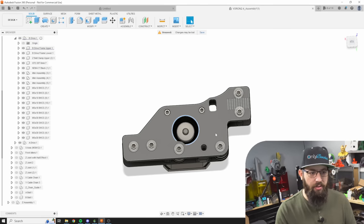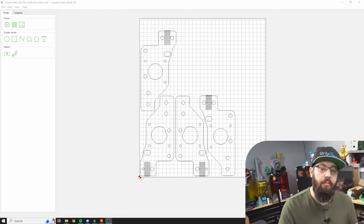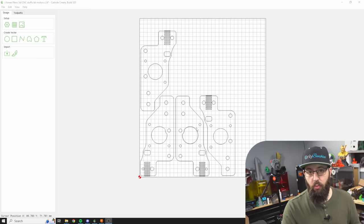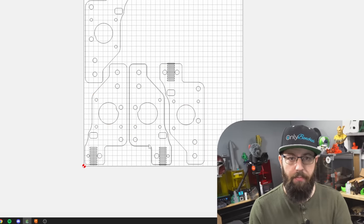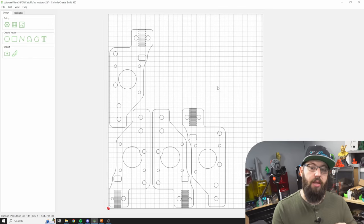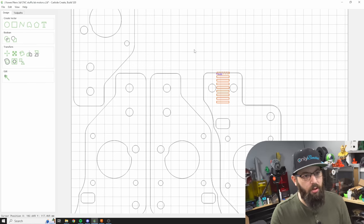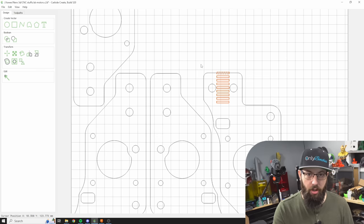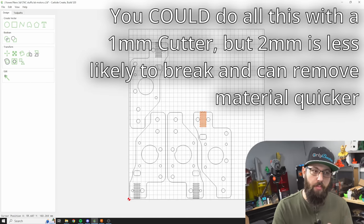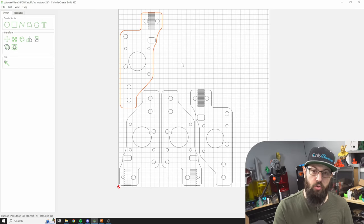So I'm going to generate some DXF files from the sketches for the top and bottom plates, and open up the CAM software — Carbide Create. I'm not well-versed in CAM yet, still learning, but for simple 2D machining, Carbide Create works quite well. We have our DXF files. We're essentially doubling up the B motor mount and mirroring it, so we're doing two of them. I'm not worrying about the drag chain mounting — we're going to mount it directly to the extrusion. When it comes to machining, there are essentially three operations. The first uses a one millimeter cutter to machine all the belt gripper sections — it's a 1.2 millimeter diameter feature, so we use a one millimeter cutter to machine that to a one millimeter depth. After that, swap to a two millimeter cutter to machine the rest.